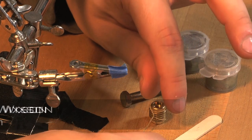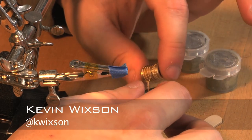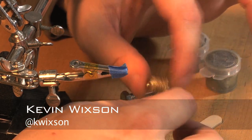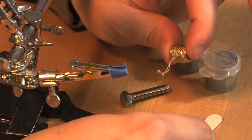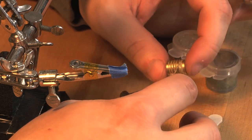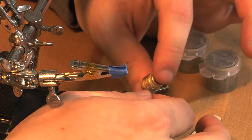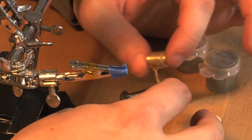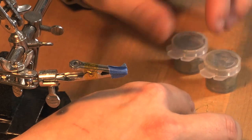The next step for building my heat core is to paint ceramic onto it to get ceramic to cover all of the nichrome wire. To be careful to make sure it's the right consistency and to not get any on the inside threads, or do my best not to get any on the inside threads so I won't have to clean it up later before I heat it up.